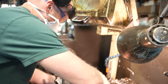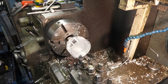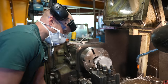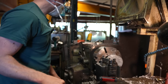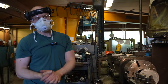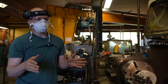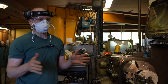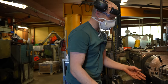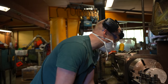So this is 2 millimeters wide. And we have a 6 millimeter thick O-ring. So there isn't any hard formula to this. I think we are going to make about a 7 millimeter wide groove. That's a bit thinner than it should be, but I don't want to make it too wide because all the stuff is going to clump there and it's going to be ugly as hell. Actually, let's make it 6.5 millimeters.